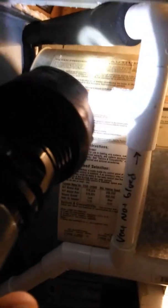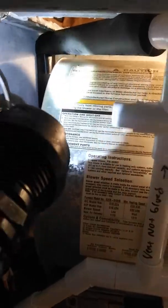I'm not too concerned about that. We'll take a look here — it's pretty darn dry for running all day. We've had a hot day today and it's pretty darn dry. So I think I've solved 90% of the water issue in this furnace system. And I'm sure if I were to get the new coil installed to get the airflow balanced, we wouldn't have any more problems.